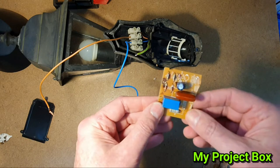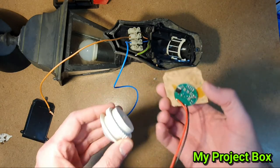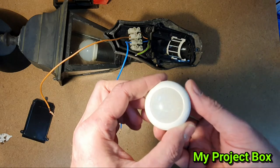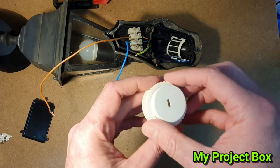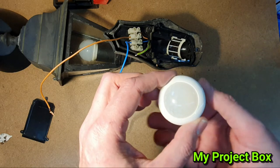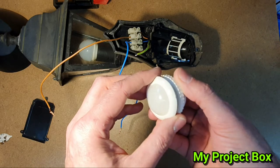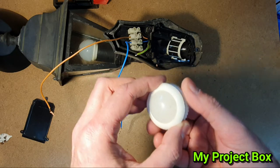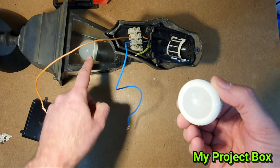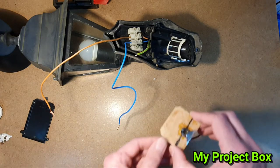This PIR here - the circuit I've mounted in there by drilling a hole in the original PCB - because it's inline it uses very little current, just trickling through the bulb's neutral to power it, and it's not even enough to power the bulb on. It's an insignificant amount of energy. It's only when it triggers the LED bulb via a triac or something that it's going to draw the 3 watts or so from the LED bulb.